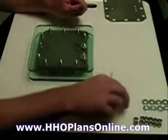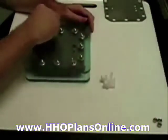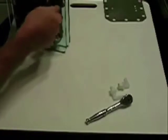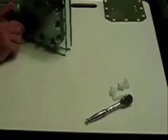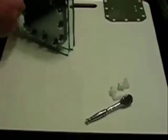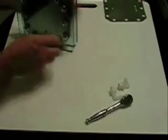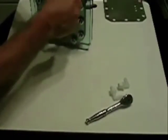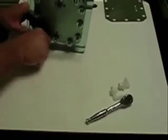Come back and put washers — you can use lock washers, but I'm using small fender washers for now. When you're torquing these — I'm just doing it hand-tight right now — make sure you do it in a star pattern, like you would when changing a tire or putting a wheel back on the car. That ensures you're getting even pressure all the way around. You don't ever want to over-tighten this material for a gasket, as you're liable to damage the gasket. Believe me, that's nothing you want when you're filling these things up with electrolyte and have to go back and tear it all apart to repair a small problem with the gasket.